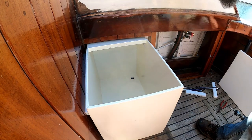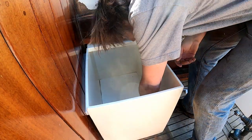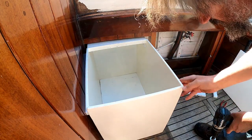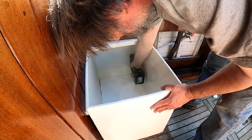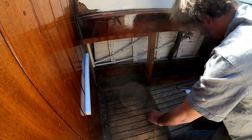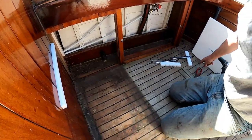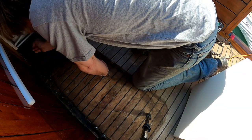The propane locker is now in position — it is time to drill the hole in the deck. I'm basically using the piece of Starboard as a template because I've only drilled the quarter-inch locator hole, and I'm going to use that to drill through into the deck straight down. There's my hole in the deck — found air, which is really nice. Now I'm going to stick my screwdriver down through so it's really easy to see, and open this locker back here and see if I can reach through. It's going to be a long reach — I may need to make an access hole in this bulkhead from under the bed.